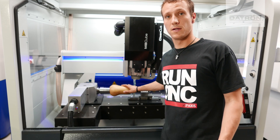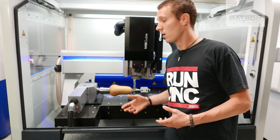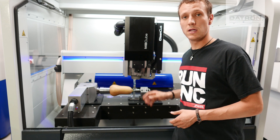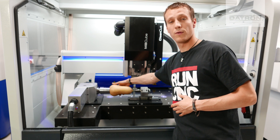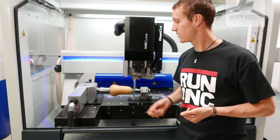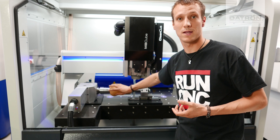As the pumpkin is a natural product, its surface is completely uneven. On the other hand, we want to have a constant engraving and cutting depth. So what we're going to do is use our 3D probe in order to create a Z-correction field over the entire shape of that pumpkin. That means afterwards the machine automatically corrects its Z-depth and cutting depth according to what the probe has measured before.